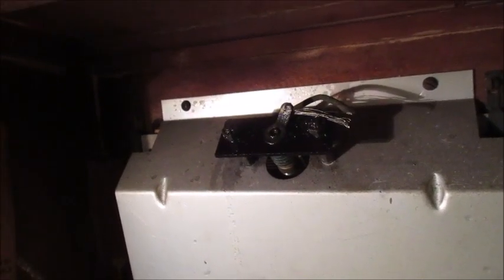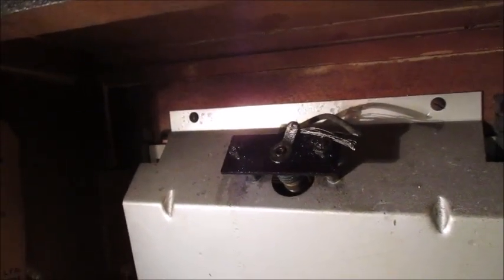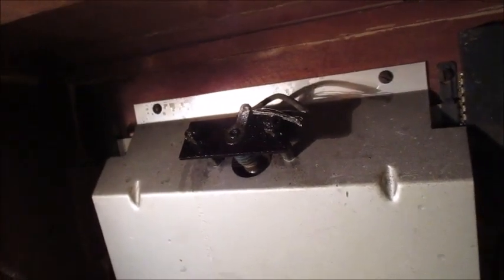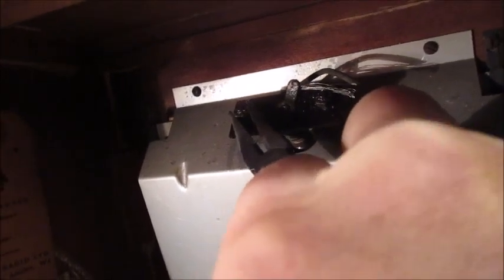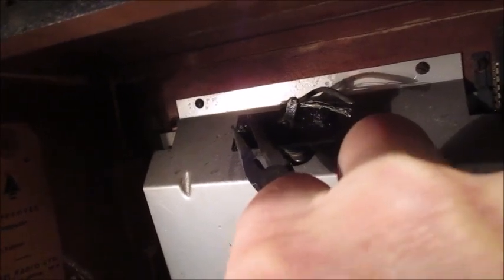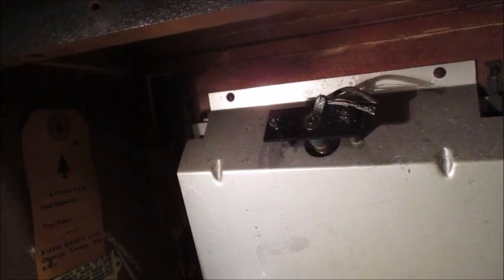I've applied a fair amount of penetrating oil onto the nuts. The nuts and screw threads, when I try to rotate them, the threaded part is twisting like a torsion bar. Brass nuts screwed onto steel threads is not the best of combinations, especially in damp conditions.